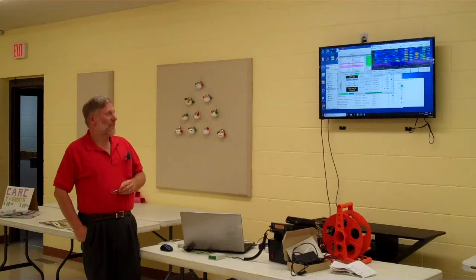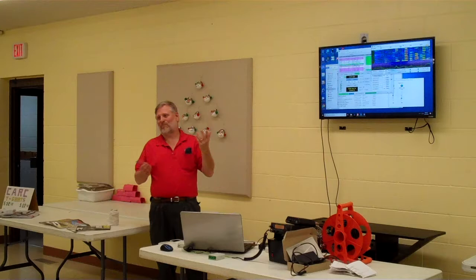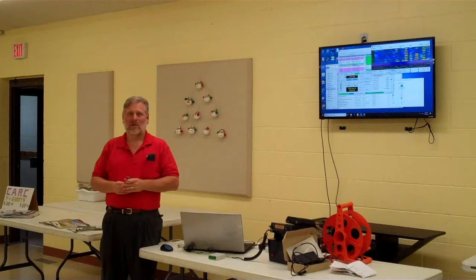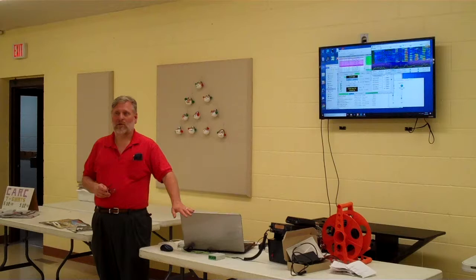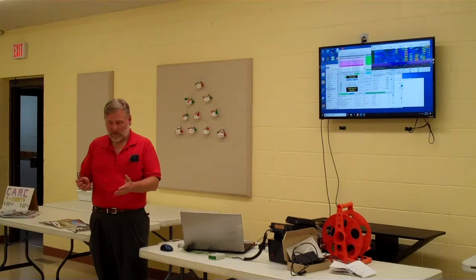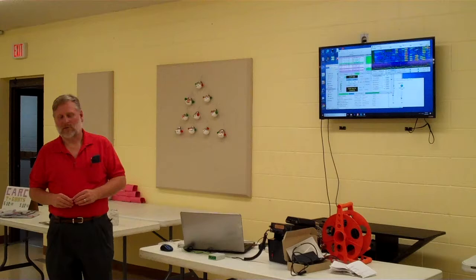Interesting. Technically, I've actually run my CW audio filter on some of these signals, and it doesn't seem to care. It'll decode it either way. It just gets rid of the other signals as well. You don't see the decodes on the stuff that's been squashed out. The audio processing itself is the big horsepower. The biggest key is to make sure your special effects are turned off on your audio card, because that'll drive you nuts every time. I see the signal, there's a loud signal, and it turns out Microsoft decided, oh, this update, I'm going to turn reverb on. Thank you, Microsoft. Don't help me, please.